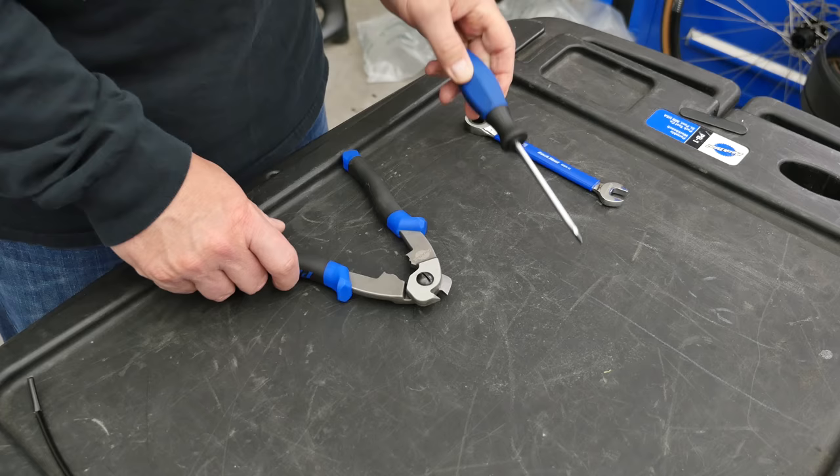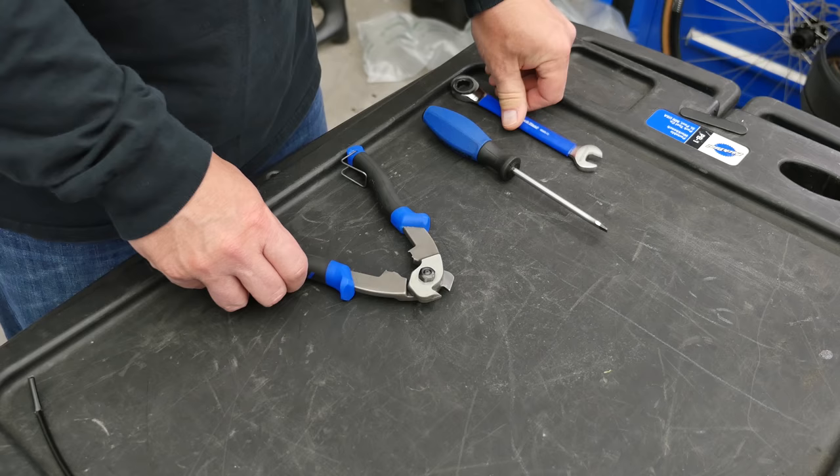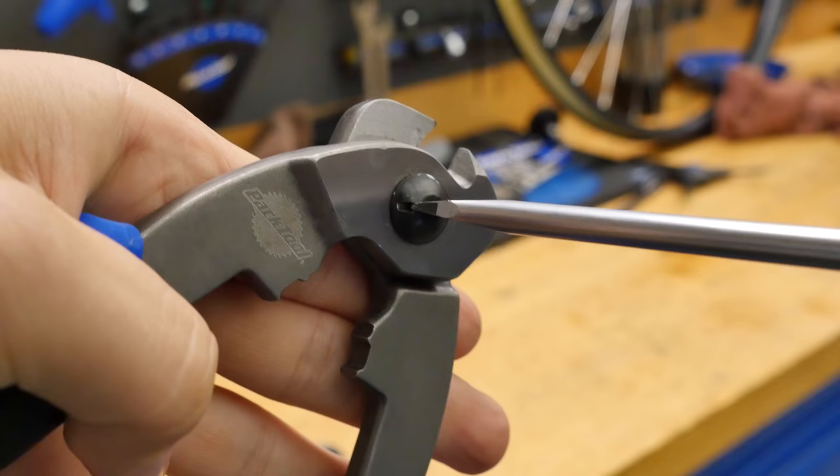On the other side of the tool, we'll fully secure the lock nut. If there is still clear knocking or play, loosen the lock nut and tighten the screw about a sixteenth of a turn.